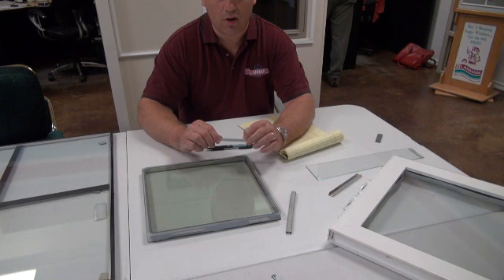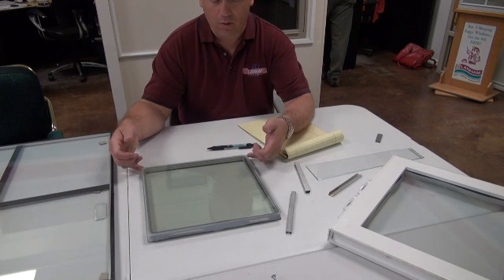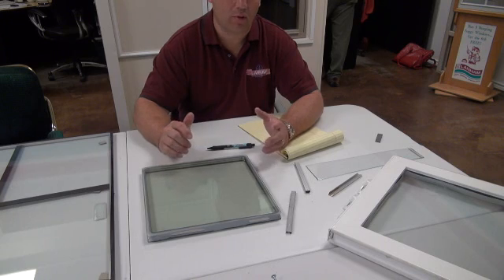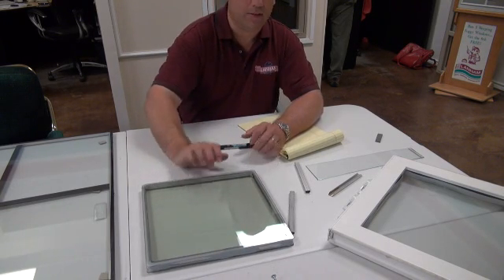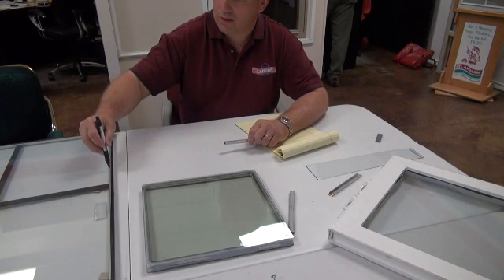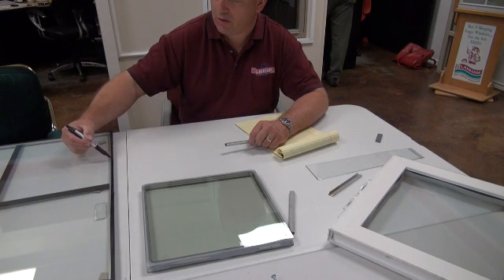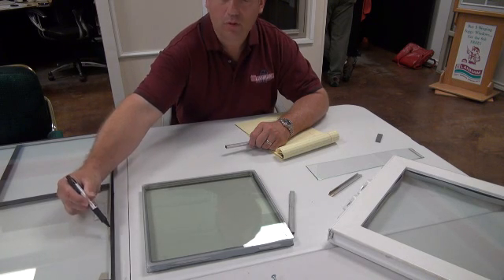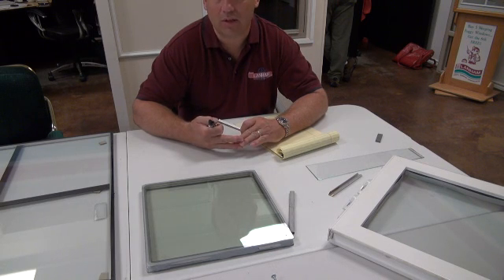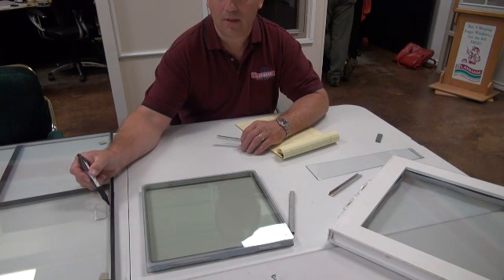When a unit fails, all that moisture has dried up or the seal has been compromised — at the corners or where the sealing meets the glass. With the entry-level aluminum spacer, you can actually see the shiny silver metal bar through the edge of the glass, which means you have glass touching metal. Anytime glass touches metal, that conducts heat and cold — and that's a big problem.